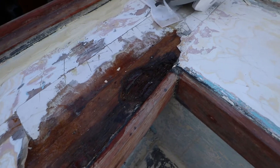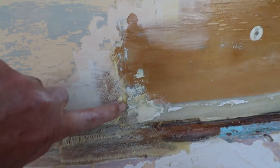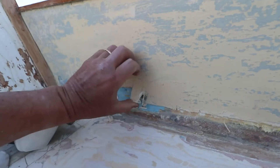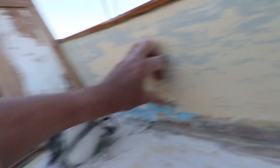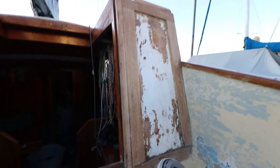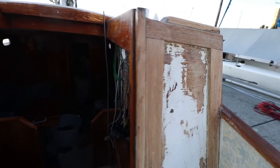They're going to dry tomorrow, and then I'll be sanding all this again. I'm trying to take this sort of stuff back, which is really quite thick — there's another one here. Look at that, that's like five mil thick. So maybe this has got to come off with a heat gun, or either that or we'll sand and fill. And then finally, on the front here, we're back to timber, ready for a clear coat — a boat coat.